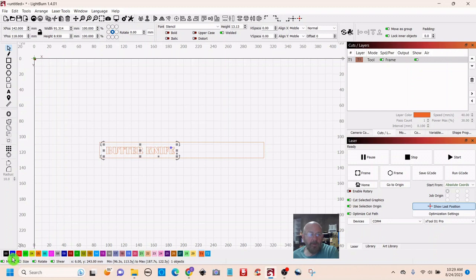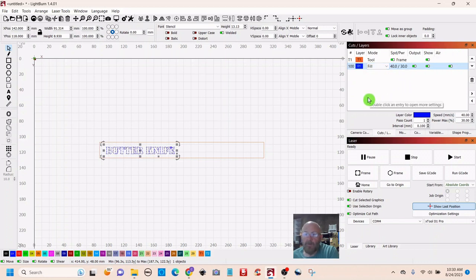And then go down to the bottom and click what I have set for an engrave, and just select whatever palette you have preset, or change any of them to work for this. And then just up here, set it to fill, not line or offset. You want to set it to fill.